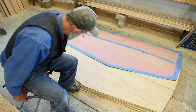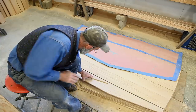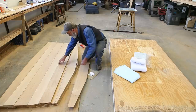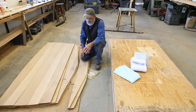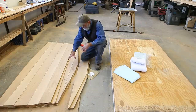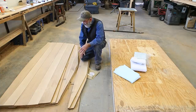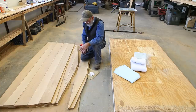You're looking at the very inside layer of the transom — obviously it's in layers, and there's six layers here. The inside and outside layers are going to go straight across the boat, perfectly straight across, but you can see that the inside layers have got a little bit of a biasness to them. The next layer down is angled in the other direction. So you've got your two cover layers — the outside and inside — going straight across, and the four inside layers on diagonals. It's not 90 degrees to itself like plywood, but it does have a little biasness, which creates much more rigidity.